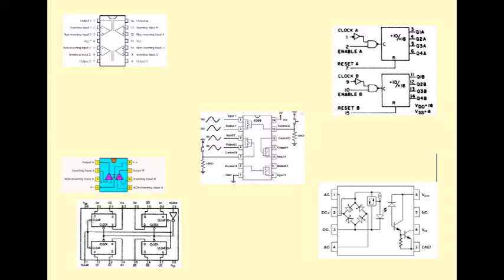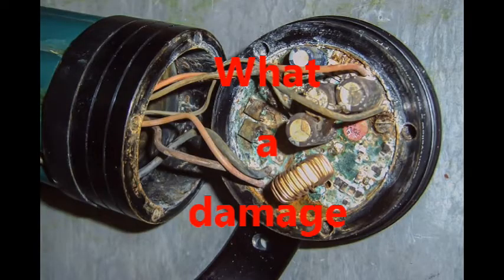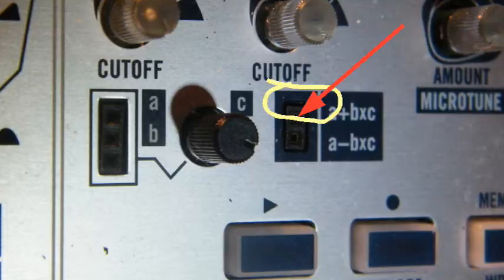But signal levels above 5 volt would have no other effect than those of 5 volt only, because no output of any electronic device can be higher than its supply voltage. And what's more, there's even one integrated circuit device on the Werkstatt mainboard which would get damaged by remarkably higher voltages than 5 volt. Than 5.5 volt, maximum 6 volt. But I'll have no problems with that.